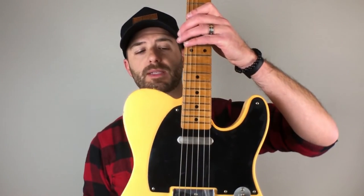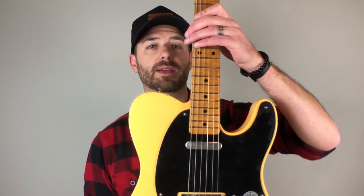What had happened is I had installed this and held it in place with a C-clamp while drilling it. The C-clamp was not a good idea — it actually slipped in the middle of me drilling it. So it was kind of wonky, the way it was drilled, and it wasn't correct. In this video I had to first make sure the neck fit the pocket in the correct position with good tight fit and correct string spacing, so I had to do a little more sanding on the neck pocket, then make plugs for the existing holes, re-drill them, glue them in, and prepare for re-drilling.